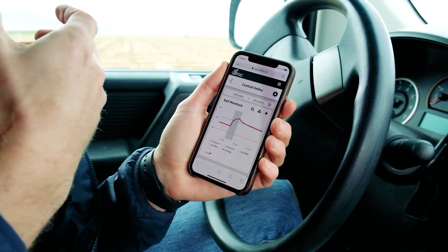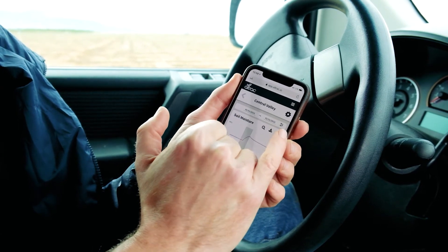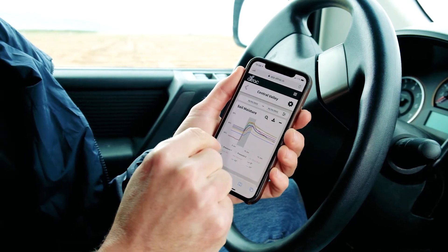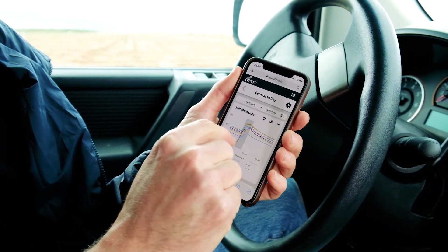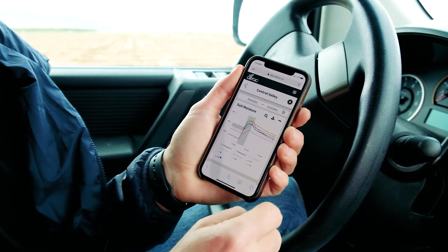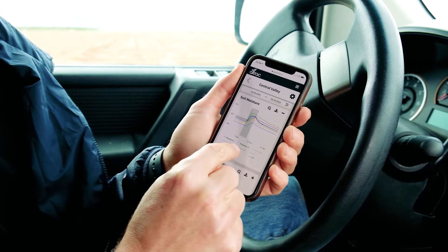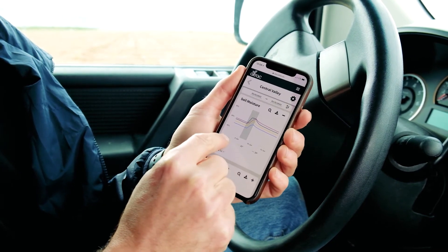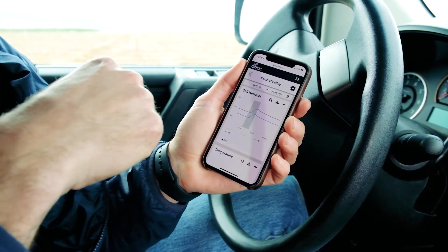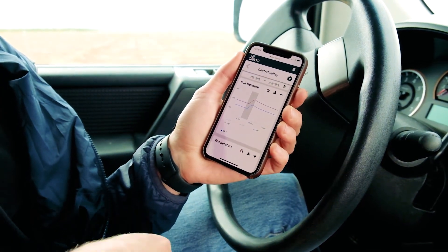This is a really long event — we can zoom in and see it's actually a 24-hour event. In California, sometimes they do that to push salts out of the soil. If we expand it with that little plus button, we'll see all the different readings from the probes. You can see the five-inch sensor started to go up first before some of the deeper probes, which makes sense because it's closer to the surface and closer to the drip. We can also turn some of those off, which is helpful because when you're irrigating you don't want water dropping straight through past your root zone into the ground.